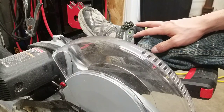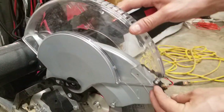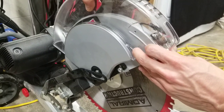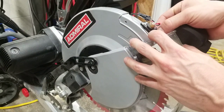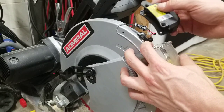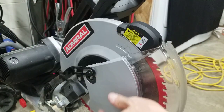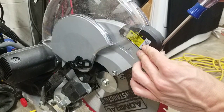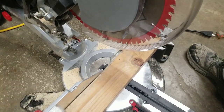Once adjusted, raise this up and unplug the saw. Move the guard over the laser — be careful not to disturb it — slide it forward and then down. Now return the larger housing, making sure the little piece is still straight. Put the black housing on, making sure the clear piece is secured inside. Put the two rear screws in, and lastly tighten down the screw to secure the plastic piece.